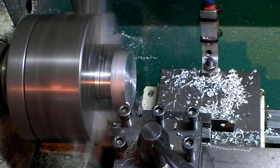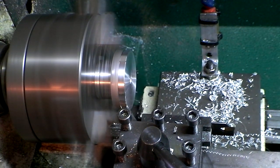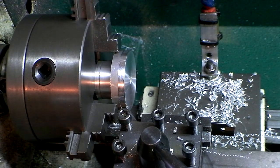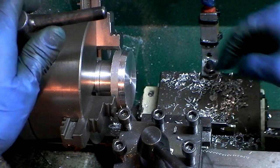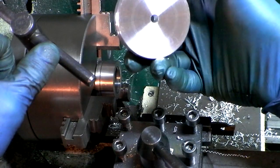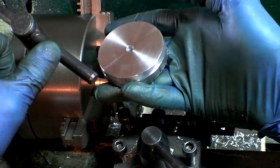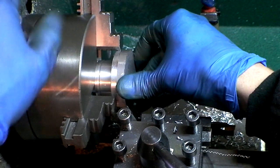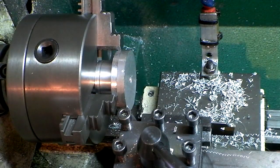Perfect. A bit of coolant would have made the cut a little bit better. I have an M5 to turn off the spindle and then an M00 which means pause the code — take it out. Coolant would have just smoothed it up a tiny little bit, but looks good. Even my fingerprint is causing a mark, it's so clean. Turn her over, hit cycle start again.